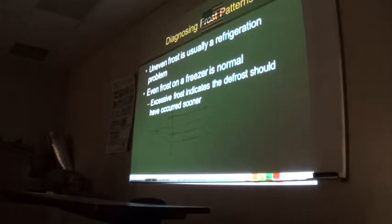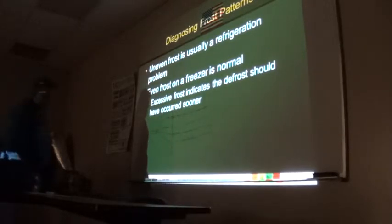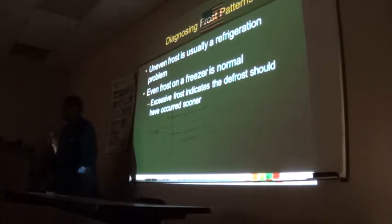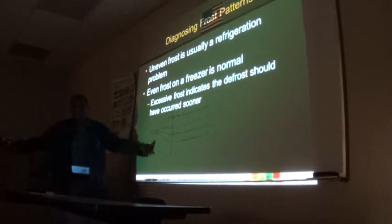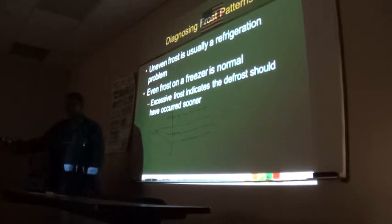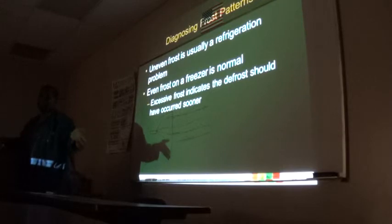So that's fine if it was running. Is it also fine to put gas into a system that you know has a leak? Well, there's a percentage you're allowed. If you're constantly putting gas into a system that you know has a leak, that's a problem. If it's the first time, I'm gonna do it, then leak test. If there's enough pressure in there, it may show up. If it shows up, then I go in there. If it's a pump down system, I pump down the gas.